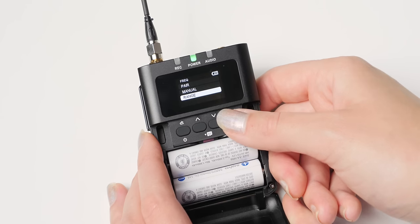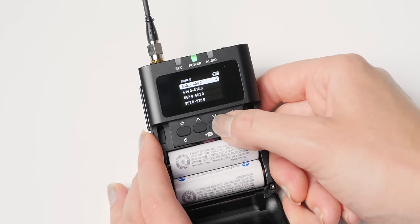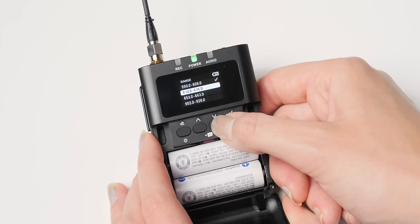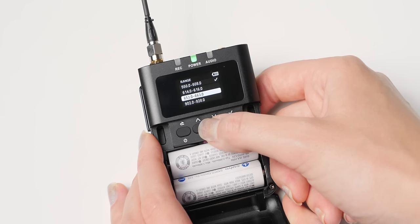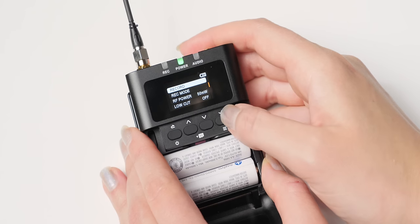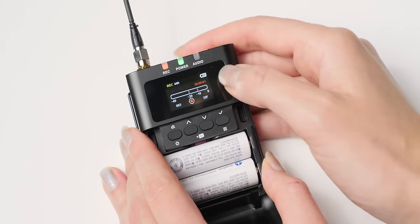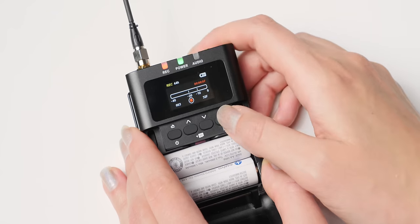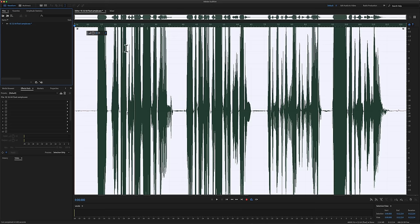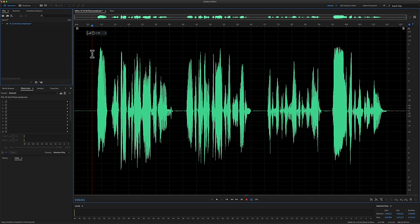With the Theos you're using UHF frequencies, tunable all the way from 550 megahertz up to potentially 960 megahertz. Not all of those frequencies will be available for unlicensed use depending on where you are in the world, but that gives you a lot of range to work with. You can also record on the transmitters — not only 24-bit 48 kHz audio, but also 32-bit float. I did a quick test and was not able to clip them irreparably; in post I could pull the audio down below 0 dB and the audio was still there. That's a really nice feature.